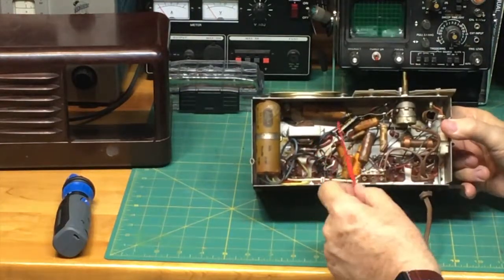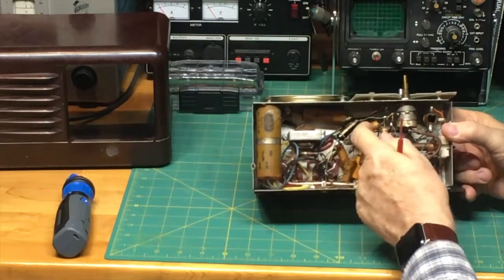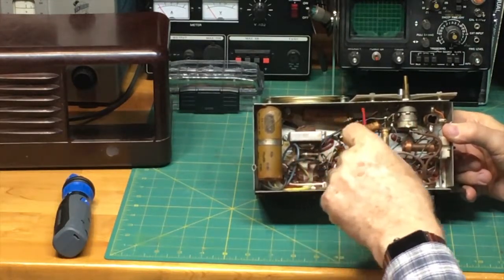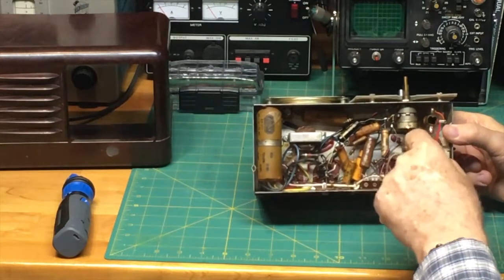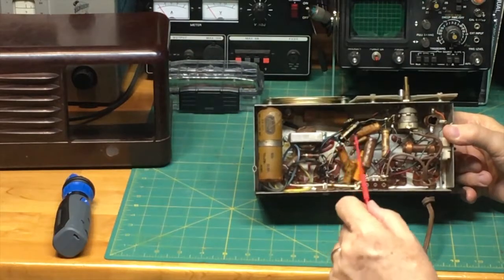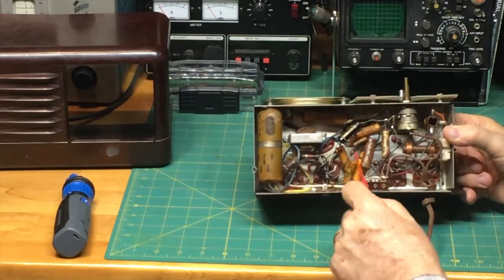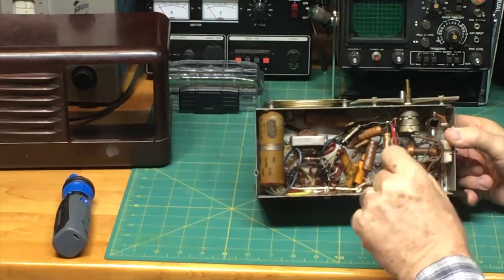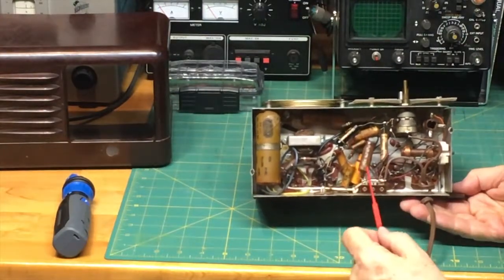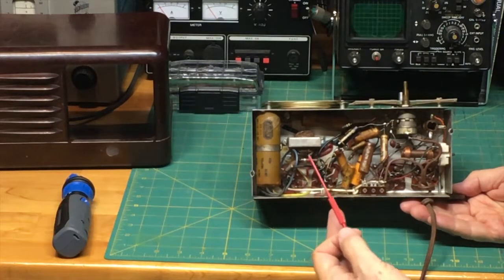We have these capacitors, and I look at them, they're all dipped in wax. You can see, I don't know if you can see where I could just scrape that off with my finger, and some of that wax is melted and has actually deposited the wax through some of these other components. So that's one problem. The moment you see a wax capacitor like this, these are old. This was made in 1954. These look like the original capacitors. So these are, as of this date, over 60 years old.